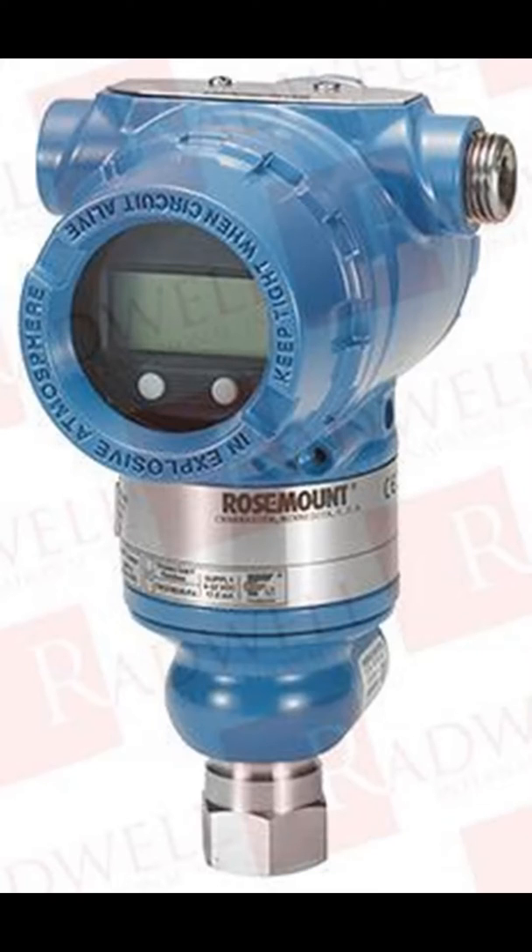In this video we're going to discuss how to test a pressure transmitter. You can see in the picture an example of a typical industrial pressure transmitter. Pressure transmitters work by receiving an input pressure value and giving out an electrical signal as an output. Most pressure transmitters give an output signal of between 4 and 20 milliamps. 4 milliamps relates to a zero pressure signal and 20 milliamps relates to the upper value of the pressure range that you want to sense.